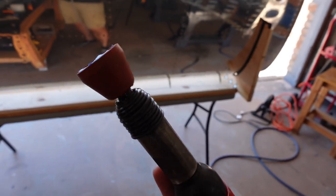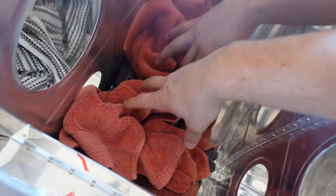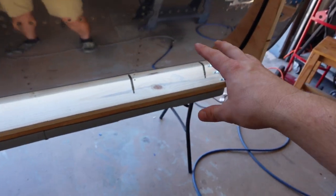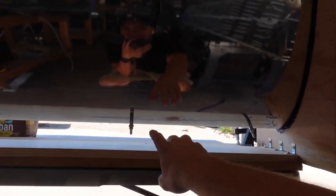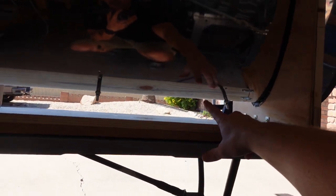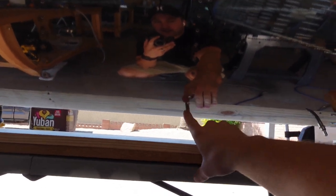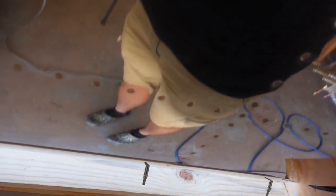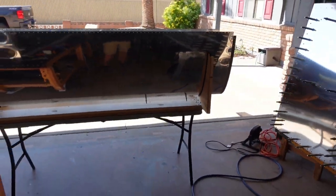I still have tape on it just to keep the scuffing off the aluminum. Just using my long ape arms, reaching inside and bucking. I do have towels stuffed in there — those help just in case I drop the tungsten bucking bar reaching in and out. I've knocked out pretty much everything and I'm down to the last six rivets — the hardest to reach ones, of course, left for last. I have these three here and these three there. Long arms, or two people, you'll probably need it.